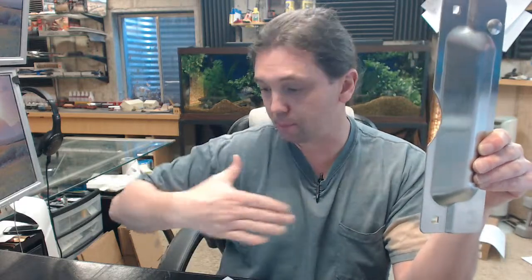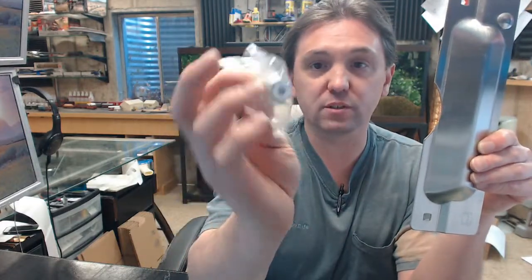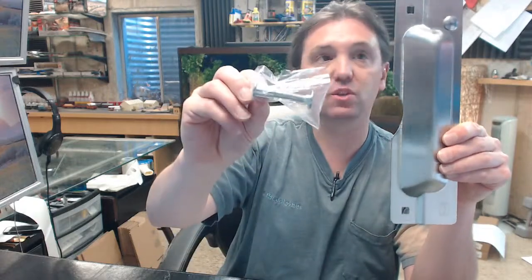I like to only use a thin drill bit because I don't want to rupture the steel on the opposite side of the door that I'm drilling, so that it makes it difficult for this bolt to sit down on. I'll have my hole marked. I'll do a reality check to make sure that hole's in the right location, then come back from the inside with a larger drill bit to get a nice clean hole. So that hole is going to allow you to get that bolt installed.